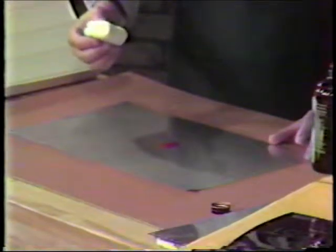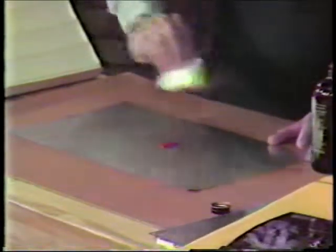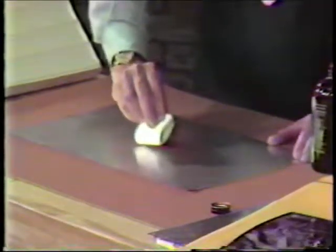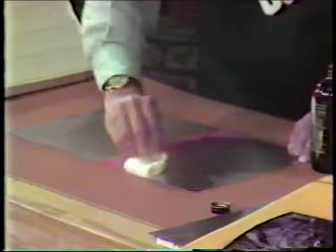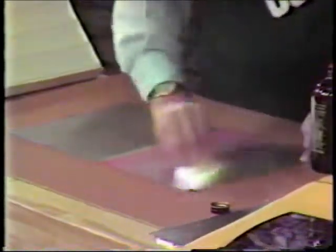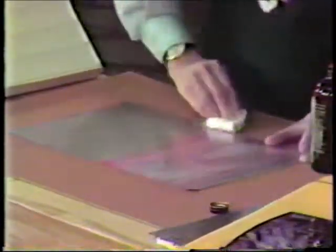Now what do I do? Now, you wipe that the same way you did the desensitizer. Side to side motion or vertical? Whatever. Just like this, huh? Yes. Don't allow your metal plate to get dry at any time. Like I just did. Yes, if you do, then it becomes difficult to lacquer and gets sticky and soft.